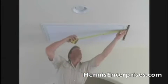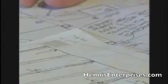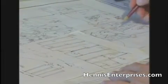This house has a large air return vent that will dictate the spacing for our beams, since we cannot move the outlet, nor do we want to have the beam overlaying the vent. So, we have taken the measurement of this vent and we use that as our guide across the ceiling. We also have several other obstacles where we might have to slightly adjust our spacing, but moving a beam several inches will not adversely affect aesthetic appeal.